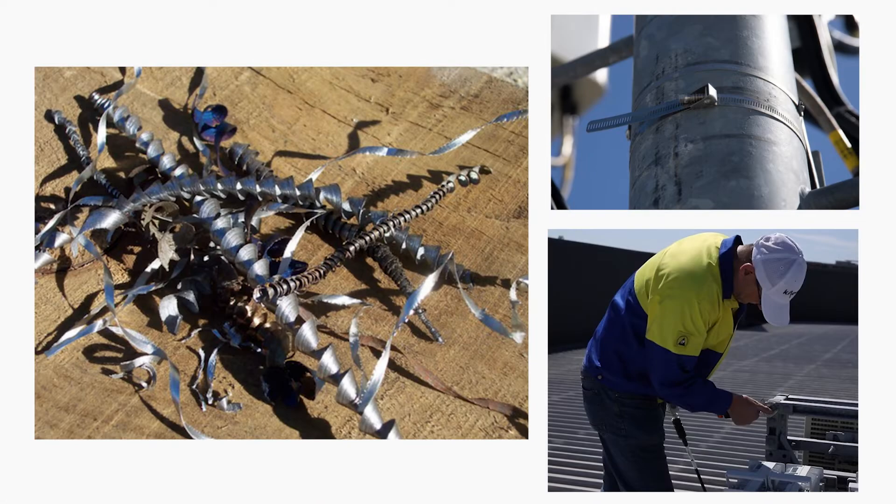To achieve good PIM hygiene of the antenna system environment, sweep up loose metal swarf, replace metal cable ties with low PIM alternatives or ensure they are tight and excess lengths are cut off. Tighten any loose nuts or bolts in the antenna beam and surrounds, and inspect all metal-to-metal contacts to ensure there are no intermittent connections.